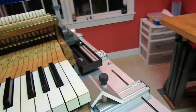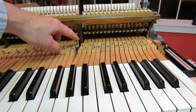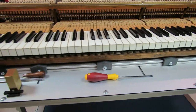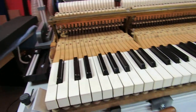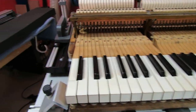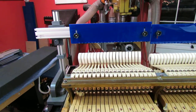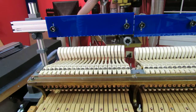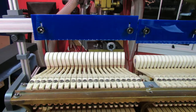The difference with the bedding platform is that it has a top that can be very finely adjusted with a screw, which is accessed under the balance rail with a 10-inch Phillips screwdriver. So once the keyframe has been bedded, the regulating rack is set up using the string height gauge, sliding base, and rail to be at strike.